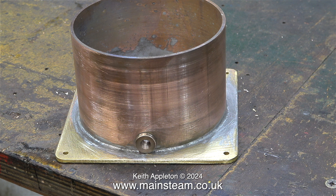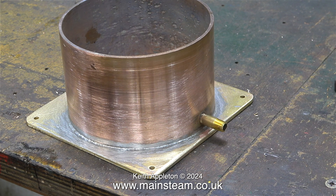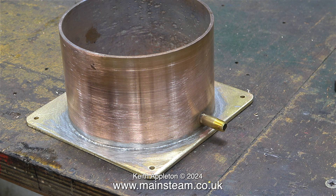Fitting the boiler bush is one modification and here is the other one. In the last episode when I did a test fit I found a problem with the cast elbow. The casting wasn't machined perfectly straight and also when I fitted everything in place the long pipe covered one of the bolt holes in the base. As you can see I've replaced the externally threaded elbow with a short length of threaded pipe.